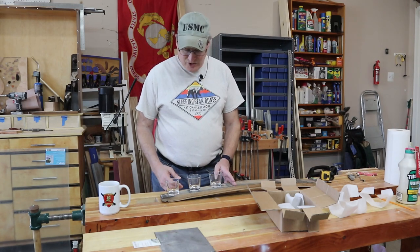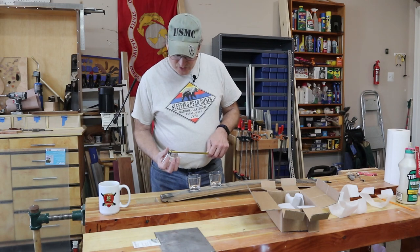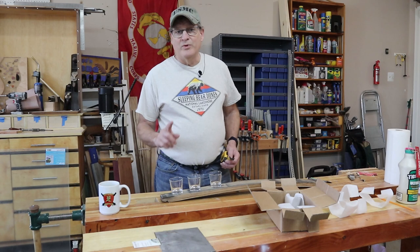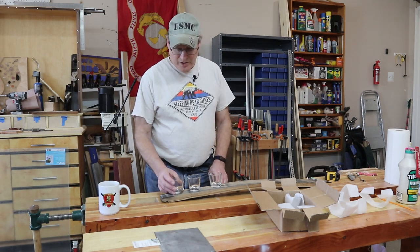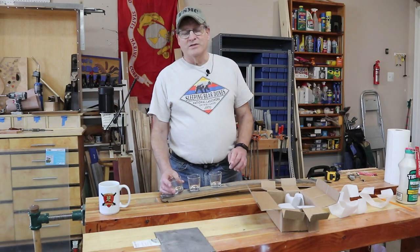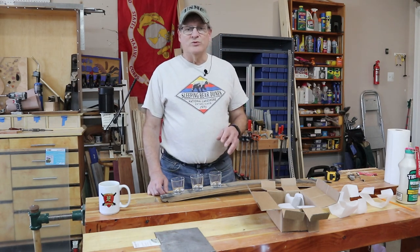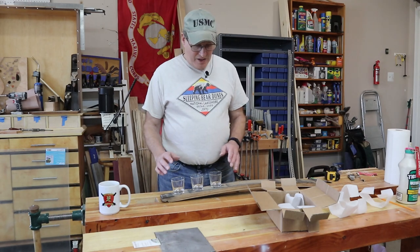So I'm going to do three. I'm going to cut this off here at 13 inches and then come back and drill a couple of holes with my Forstner bit. That Forstner bit is going to be two inches, because these glasses are just under two inches — about an inch and seven-eighths. I'm going to use my drill press because it's going to give me a hole that's perpendicular — straight to the world. I don't really want to see my glasses leaning when I'm drinking. I'll put links in the description for the materials and tools I use. Hit subscribe and like!